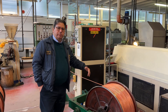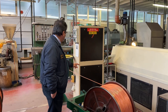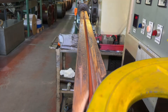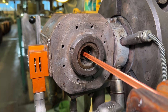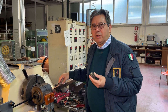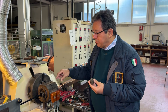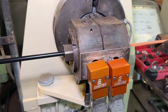The braided wire — this is a braided coaxial cable — is being unrolled and brought towards the extrusion head so that the jacketing can be applied. The braided coaxial cable, which is not yet coaxial cable, will become a coaxial cable starting from here, as the braid passes through the extrusion head and comes out with the jacket.